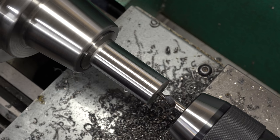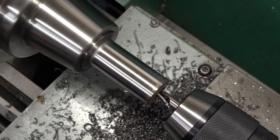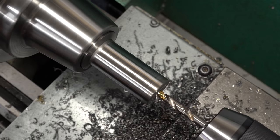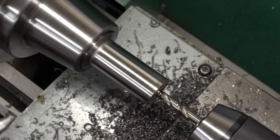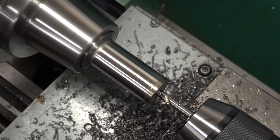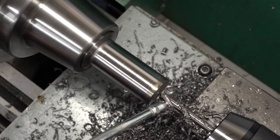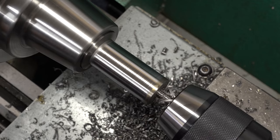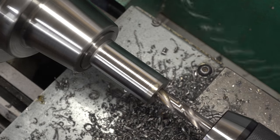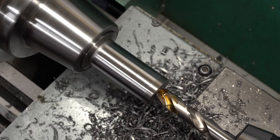I was running that too slow, so let's speed it up and push the center drill in. We just need a spot to start a quarter-inch drill, and we're going to drill this in steps because this is a small lathe. I'm using a screw-machine-length stubby drill and backing it out to clear the flute so it doesn't get packed up. Now coming back with a 3/8 drill to enlarge the hole — that makes a ton of noise until it gets fully seated. And now a half-inch drill — if you thought the 3/8 was loud...